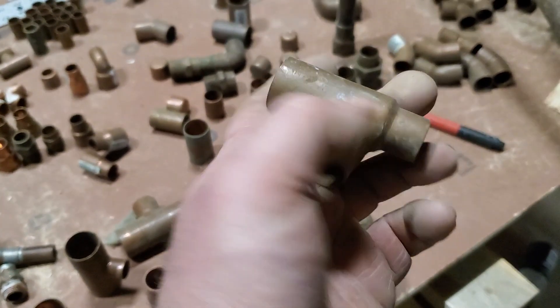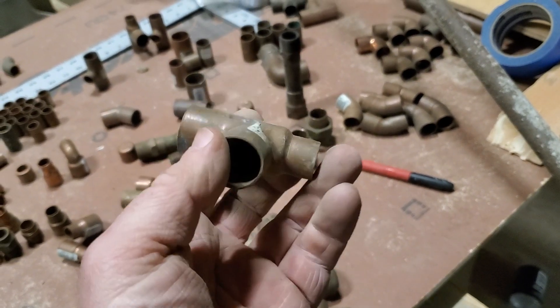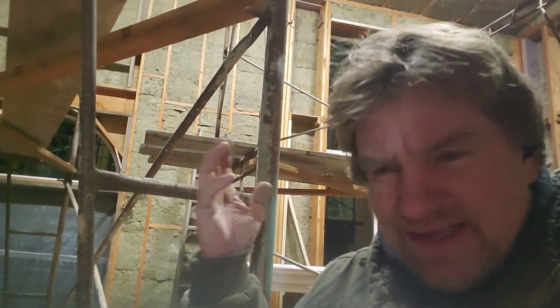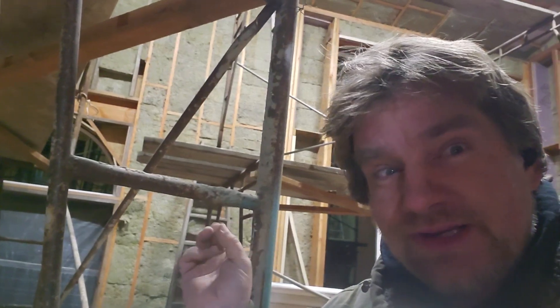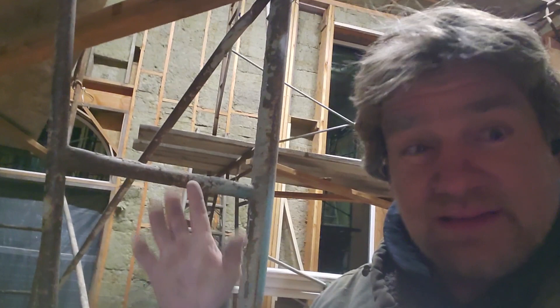I wasn't planning on doing my manifolds out of copper, but other than not having enough one-inch tees, and I can only imagine what one-inch copper waterline costs — probably won't use any of that, that's probably copper scrap someday. But the rest of it will be useful. Those vertical runs where I'm going upstairs — this is perfect. I'll solder on that little drain valve like I was talking about in a previous video. I don't trust squishy plastic plumbing connections inside my walls over the next few decades. What I do trust is sweated copper, which will essentially last until the meth heads get in here and strip it out. So I'm going to run hard copper in all of my walls, and I'll run PEX underneath. The hard copper will all come down through the core of the house, then it'll tee into PEX, and PEX will run over to where my water comes in, the pressure tank, and the filters.